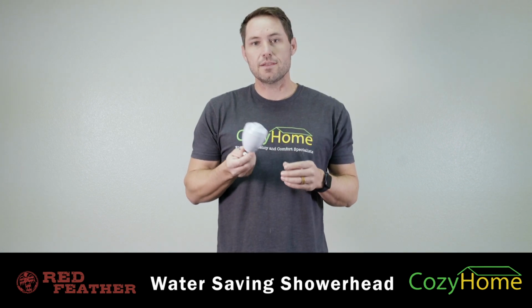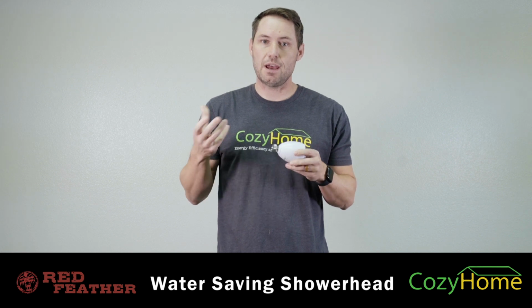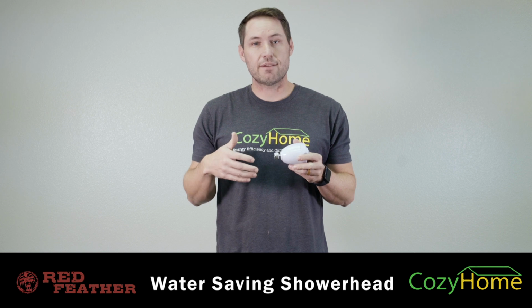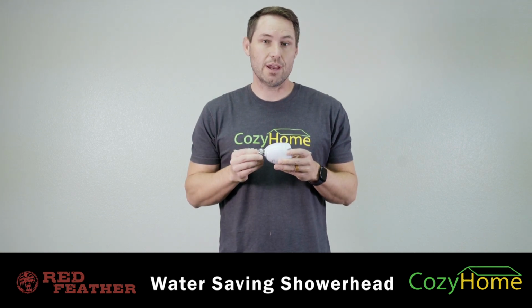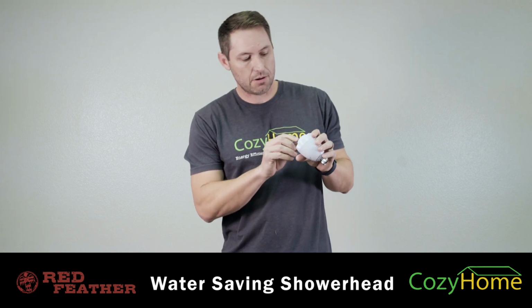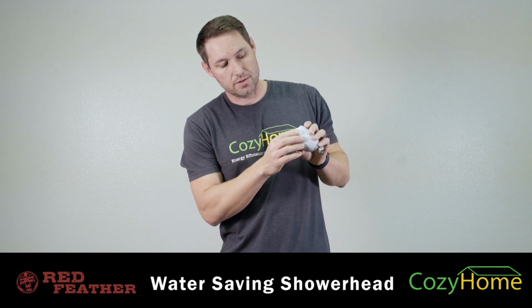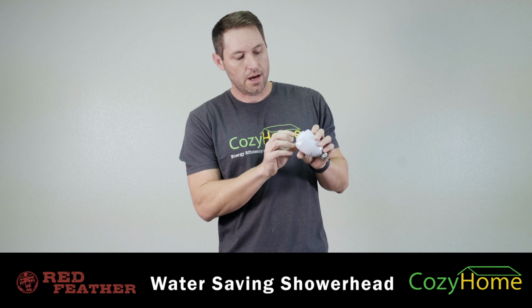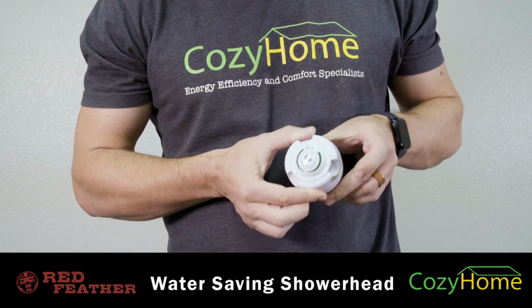This is a shower head that's a water-saving shower head. So most standard shower heads that you might have in your home will use maybe anywhere from 2.5 to 3.5, 4 gallons per minute, depending on how old the shower head is. These ones use quite a bit less than that. So on the front of your shower head, it usually says exactly how many gallons per minute the shower head uses. And if it doesn't say that, it's probably really old and is using a lot of water. So this one says 1.25 gallons per minute in little letters on the front of this.